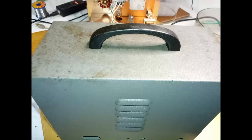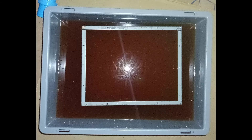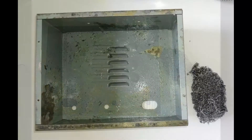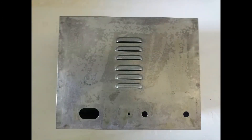The cabinet showed signs of rust trying to emerge from underneath the protective lacquer. Therefore, to remove the lacquer and the rust, the cabinet was submerged in vinegar for more than two days. The cabinet was then cleaned with the help of some steel wool, finally washed, dried, and then painted again.